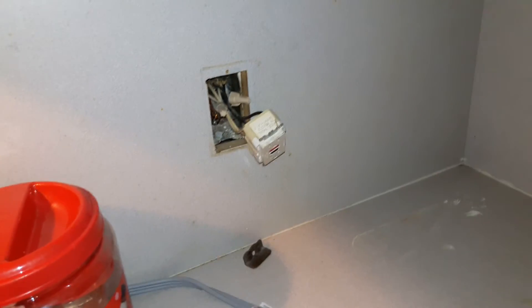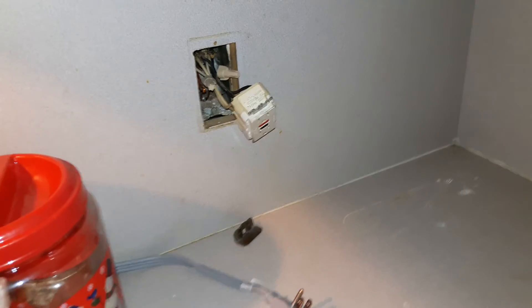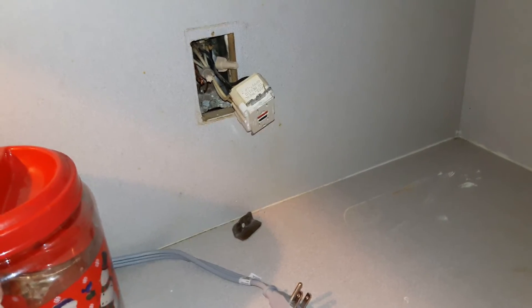If you check that one, same deal. And you come over here, and I have the breaker off obviously because I've got the wires all out of the outlets and stuff. But if you check them here, they're at the best 95 volts, which is 15 volts too low, and apparently that's enough that the microwave doesn't work half the time.